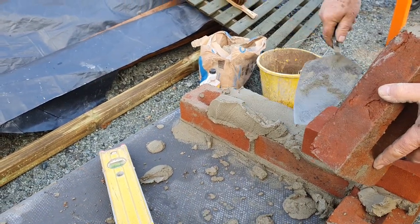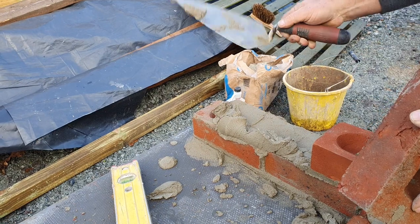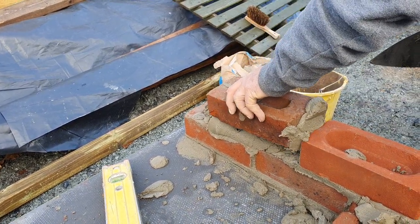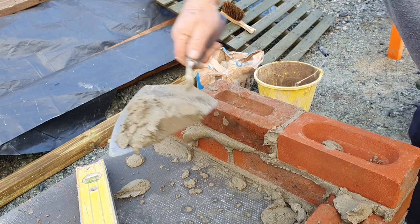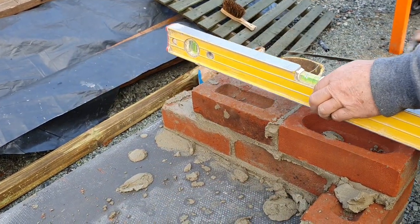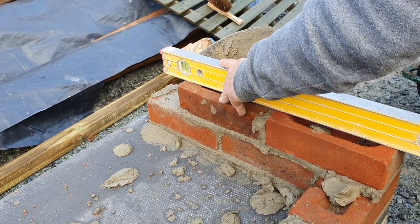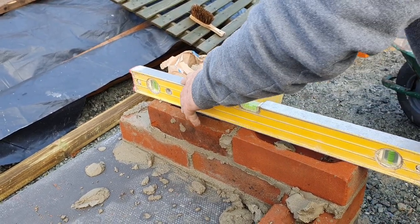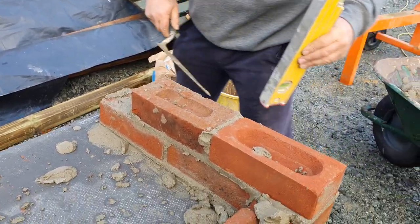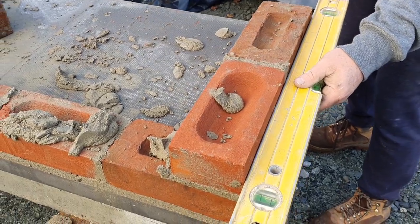So the theory is: if you can build a small corner, you can build a big corner. All the principles are the same — let's put this on a bigger scale. Nothing changes really, it's just bigger. We've got more plumbing points obviously. You can see you don't see many people raising corners now because on big sites they use full profiles. But often when you're on a little job, you've got to be able to do it. We've got that level. We'll try and get that level in — we've got that point level so we can now go across. And that's pretty good. There's no real gaps.